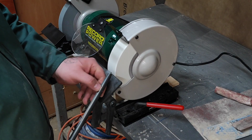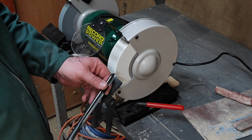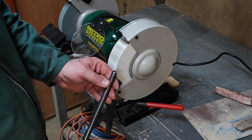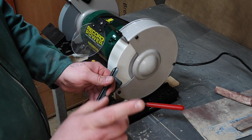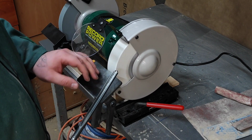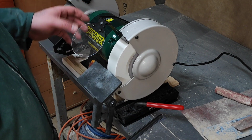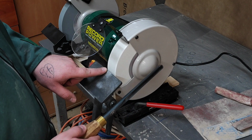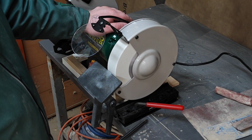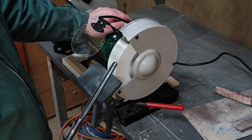Okay, so as it spools down, this is a 100 grit and this is a 36 grit wheel. And now as I watch, this is much finer than anything I've ever used. Actually I did have a 120 wheel, and that was much too fine for me. I'll play around more with the setup, maybe change this to the other side or switch the wheels, although this is 40 mil and it has a longer arbor here, so I'll see what I can do once the CBN arrives. I'm quite happy with this. It's a much improvement over the old one.